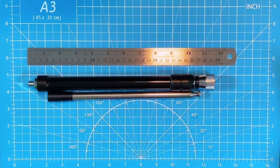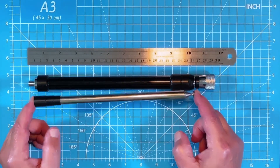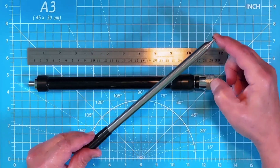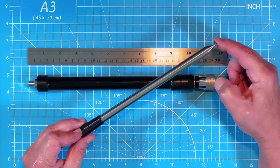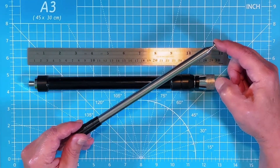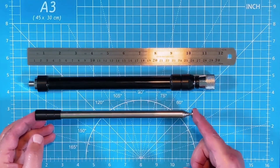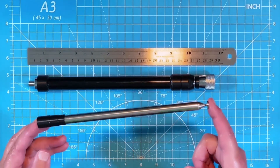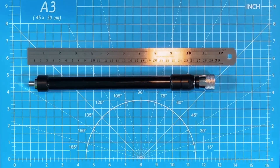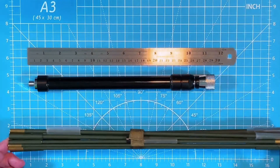We'll find out — we're going to get this thing on 40 meters, or at least attempt to. We have a really small telescoping mast. This thing is just under 10 inches collapsed and expands to 7 feet and 2 inches. It's not as long as we might want because height is might — if we can get this up to MFJ-1979 length or Chameleon Antennas SS-17 length, we're about resonant on 20 meters. We're not going to get there with this. But I use a very similar compromised antenna frequently with my Wolf River coil.